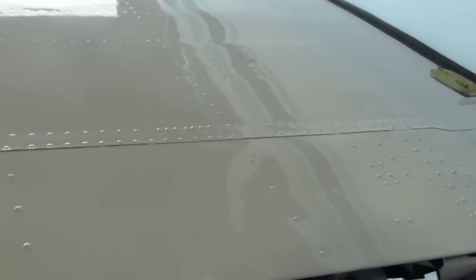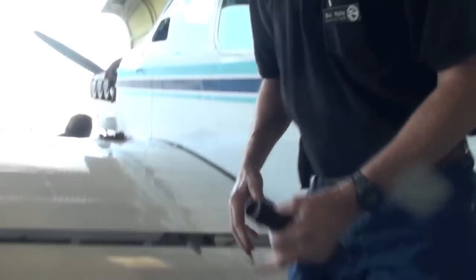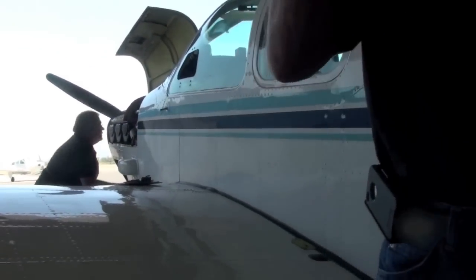Grab that flashlight from my red bag. It's in the very front pocket. That's the only place we're going to use LPS-1 on the whole airplane. LPS-1 is like sewing machine oil. Because of the conditions those switches are under, the dirt and the dust, if you use LPS-2, it's gummy and it attracts the dirt and it'll gum the rollers up and they won't move. Those rollers need to ride up and down the ramps as the flaps move.